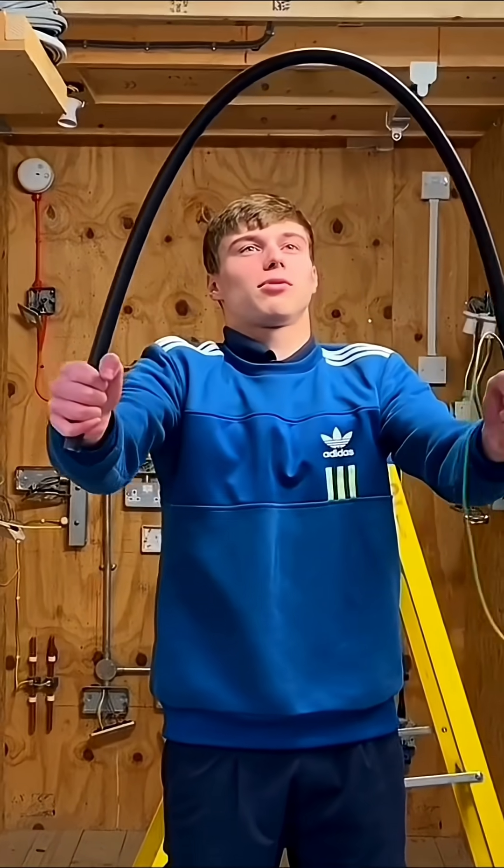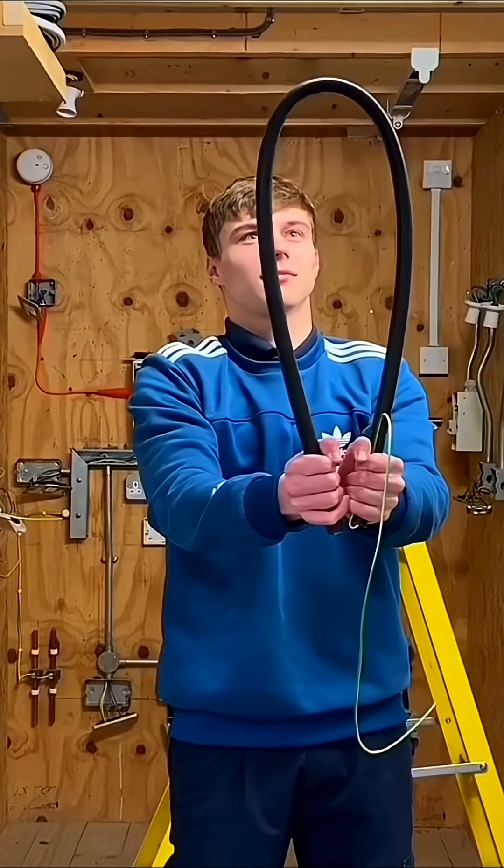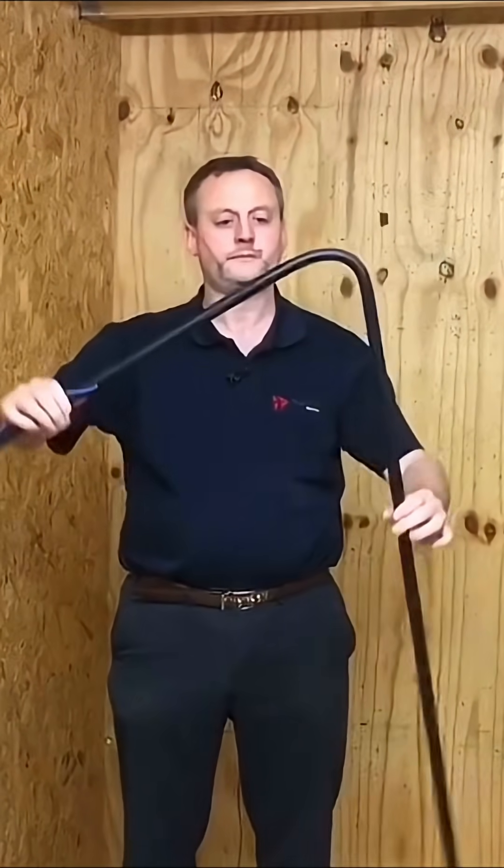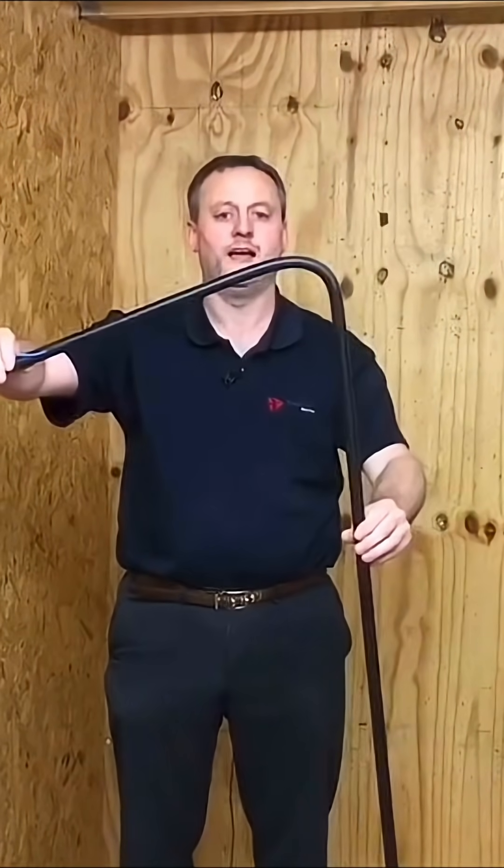Fold it in and hold it, then out again — hold it in. I want to leave it in a slightly overbent position, resting it beyond 90 degrees, possibly about there. The spring needs to come out at this stage and it needs to be rested — give it a couple of minutes before we even consider trying to cut it to the required dimensions. So the spring comes out and we're going to rest it in an overbent position for a few minutes.